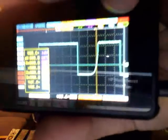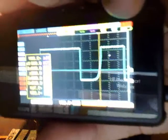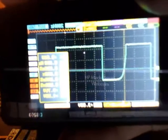Okay, we're gonna do a test there. There's the duty cycle at 5 volts, and you can see, look at that long square there, it's on a lot longer than it's off. It uses pulse wave technology, and our voltage peak to peak 9.7, and we had 4.8 volts. It's DC volts putting out, so that's pretty darn close. That's decent for what it's doing.